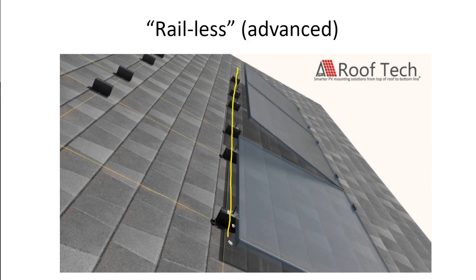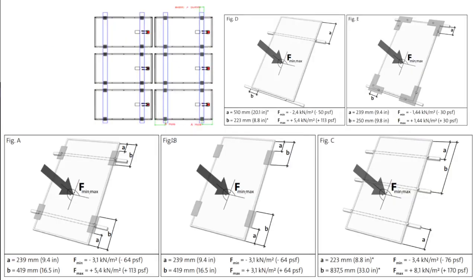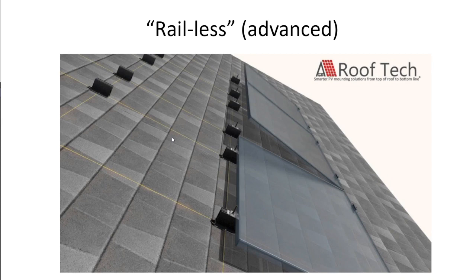When you get rid of the rail, when you no longer have that overhang, and you use a railless system, you have to be very, very precise to make sure that it all fits and lines up as it should. So most solar installers are using rail-based systems, and only the most experienced crews move over to a railless system, which is a little bit cheaper. Not much cheaper, but a little bit.